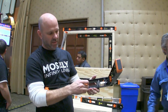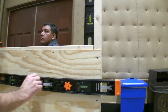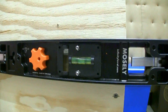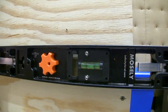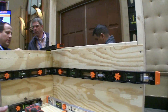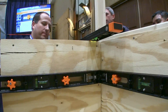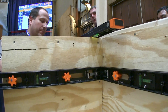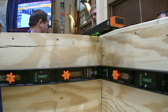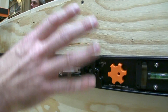And then we have this cam adjust, so when you attach it to the wall, you can adjust it to level on the wall. You can fine adjust it once you're there. So like someone doing tile might use that? Exactly, for tile, for cabinets. And then it slides on a slide, and it's designed to catch 16 on center. So if your spacing's off, you've got a little play.